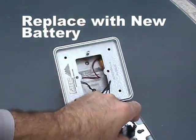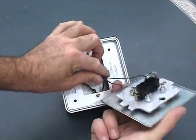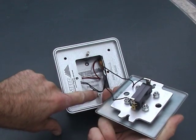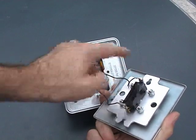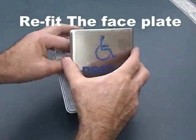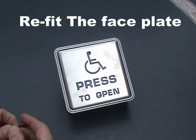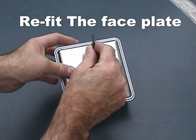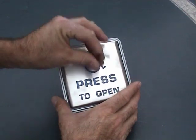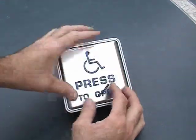Replace it with your new battery, just plug it back on, and that's it — it's as simple as that. Tuck it back inside the box. Then it's the reverse procedure to refit the plate: drop the bottom slot onto the bottom screw, then drop the other screw into the keyhole, wiggle it about, and it will locate. There we go — that's relocated. Then take your allen key again and tighten up the screws in the reverse way that you took the plate off.